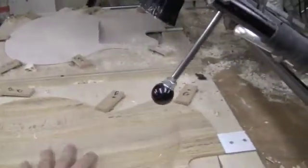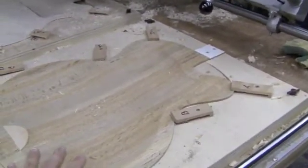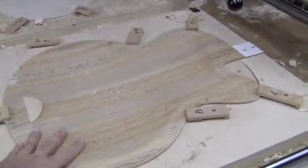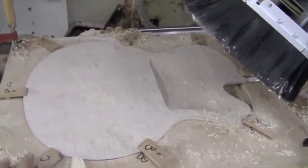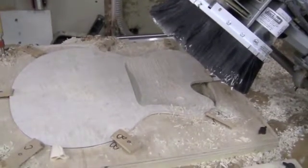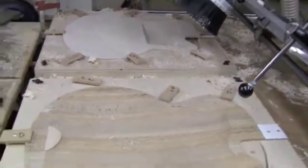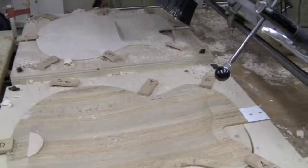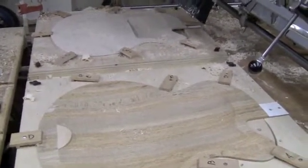One is the bed, and on the bed I have a place to mount a wooden template for my arch-top guitars. This is something that I've carved entirely by hand, and on the other side of the base I have a place to put a piece of wood that the duplicator replicates. It takes me about 40 minutes to rough-carve the inside and outside of an arch-top top or back, and it is really just used for roughing. I do take the tops and backs down to final shape by hand with hand planes, spoke shaves, scrapers, that sort of thing.